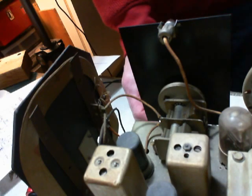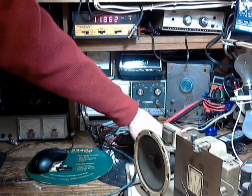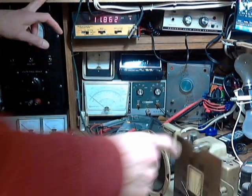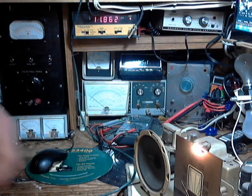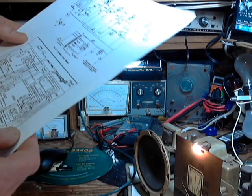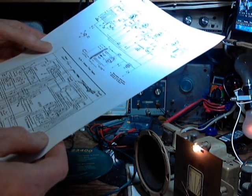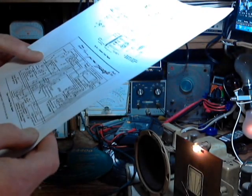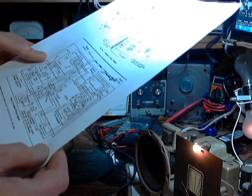So why don't we start the alignment process on this radio. The first thing I gotta do is switch it on and warm it up. Quick safety check — looks good, switch on. And it's on restricted power to start. Almost certainly the IF in this is 455. Let's see if by any chance it actually says it here. And it has a recommendation of where to hook up your oscillograph. I don't have an oscillograph, I have an oscilloscope, but we're not going to do that. We're just going to monitor the output volume right on the speaker.